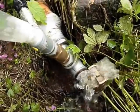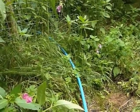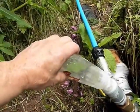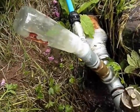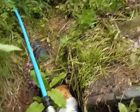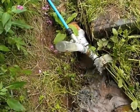It starts up okay anyway. What we need to do is see if it's pumping water. I've set up a temporary pipe going back to the pond and I've hung it out of a tree, just to see if we're getting any kind of pressure at all. Because obviously I don't want to waste loads of money making this if it doesn't work. I haven't got any more head - that's all I've got. And I've got to try and get it up to the top of this hill up here. So it's a tall order for a ram pump to be honest, but we'll see how we do.